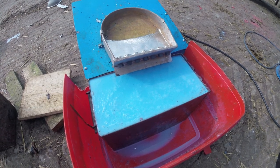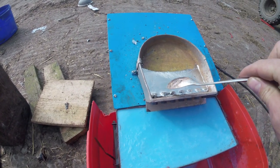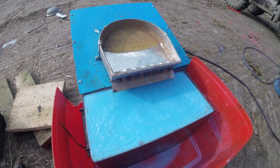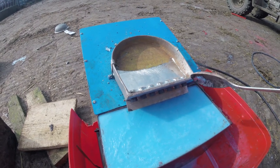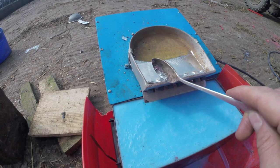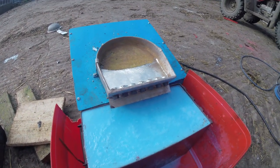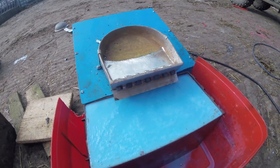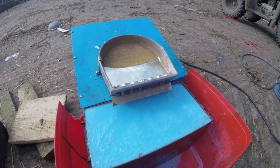When these jets start to appear, you know the size of your lead is going to start changing, getting bigger, because it's starting to blob out instead of just flowing out fast like this dripper here. See, so tapping them is making them go, but these are clearly bigger than those over here. So I will now stop production there, set the machine back, switch it off, and show you guys what I just made.